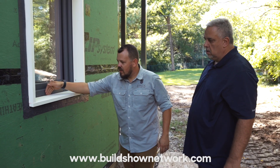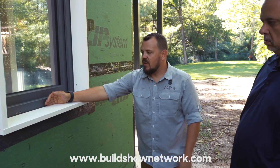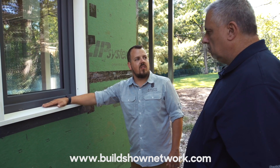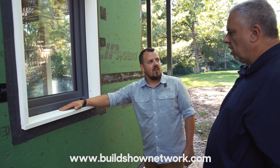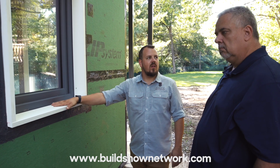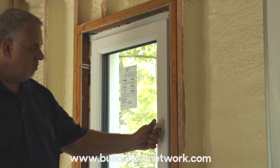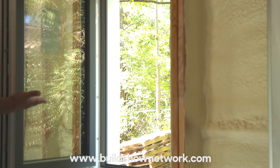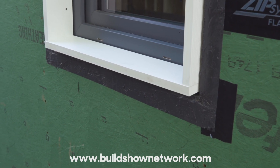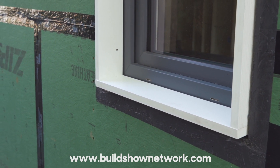We actually have about an eighth of an inch behind this PVC between the PVC and the window. If we shoved it tight, most people would think we need to caulk that — but by leaving that joint there, we're opening it up, allowing it to dry better, and not introducing a caulk joint that we'd have to maintain over the years. The most dangerous thing about a caulk joint is understanding that you don't ask 'what am I keeping out?' — ask 'what am I keeping in?' Because no one can do a caulk joint that is going to keep water out for the life of that caulk joint.